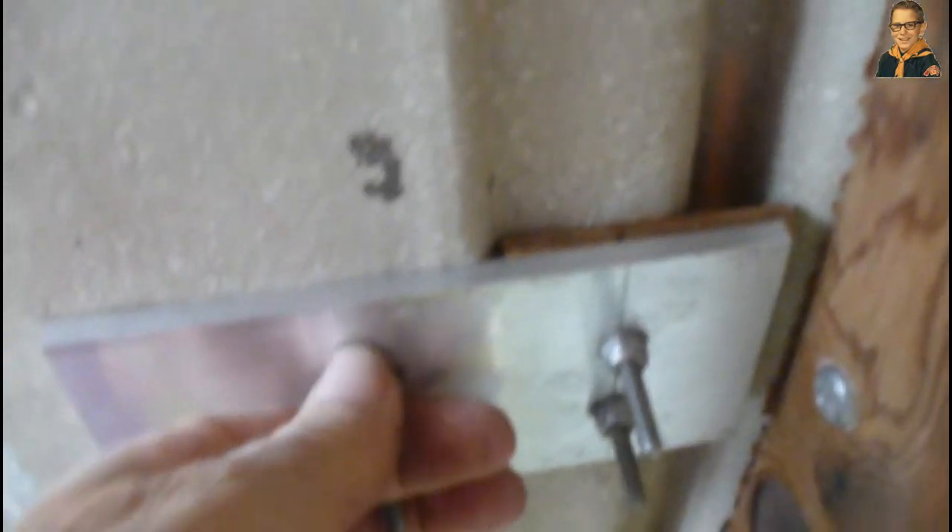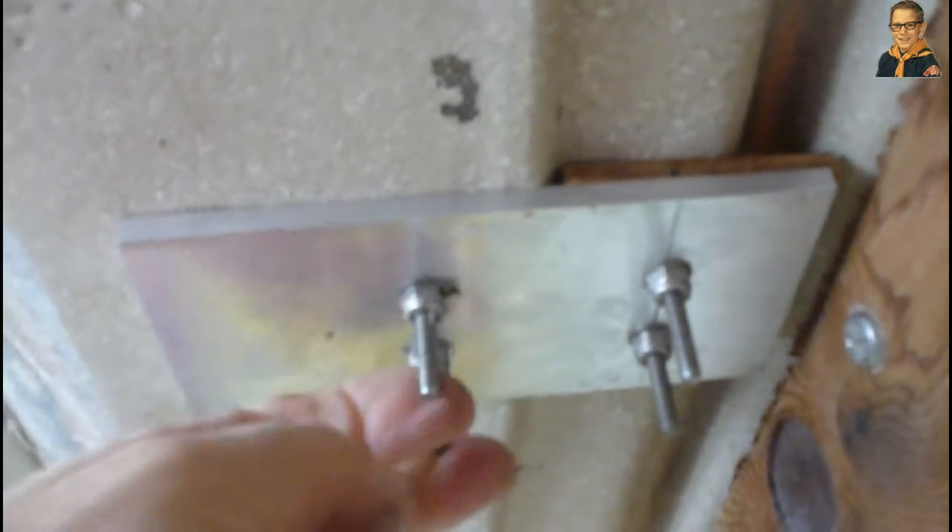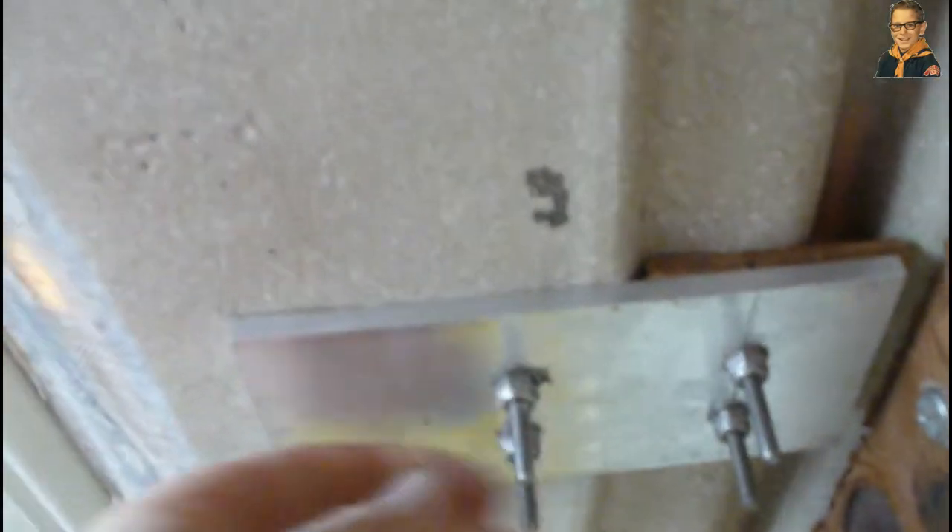I did that on all six of these. I had that one there, that one over there, and that one there as well, and this one. But each one of them had a little indentation — a piece of wood that was missing, that was built into the hull. And this is where that piece of wood is. I saw it on a 3/8 and it was too much, but this is a 3/16. If you're going to put this kind of support on your stanchions, obviously you're going to have to go underneath the hull and see what you've got. You need to know how thick it is as well. The real test is when you need it.